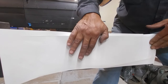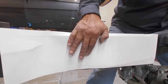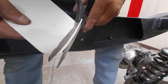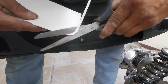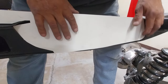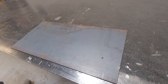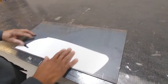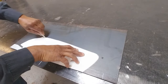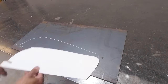We want to be really accurate because our boxing plate is only going to be as good as our template. Take a little bit of time — if you have to wad that one up because it's not right, throw it away and start over. A final few adjustments, and boom. We notice we're tying it into the front webbing and this frame is not straight up and down, so we have some adjustments to make. Transferring the template onto the steel plate for boxing — there it is.